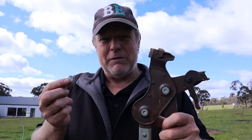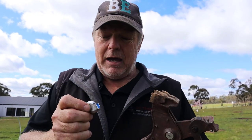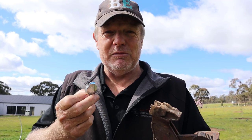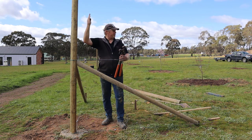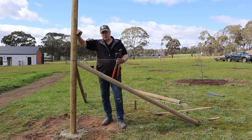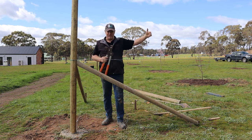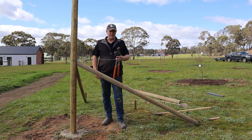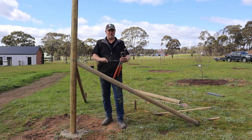We love using the gripples — it just makes fencing so much easier. We've used these extensively right around the farm and will continue to do so. They even come in handy setting up trellis for vines and grapevines. There's a tiny hole that allows you to insert a fine piece of wire to release the teeth, which means the wire can be extracted, so they are reusable — we've picked up secondhand ones and reused them as well. The next step is to run wires up the posts at a height that will dissuade kangaroos, with star pickets supporting the middle parts of the fence to stop big kangaroos from jumping across into the orchard. These higher wires won't be under as much tension as the ones holding up the mesh fence.